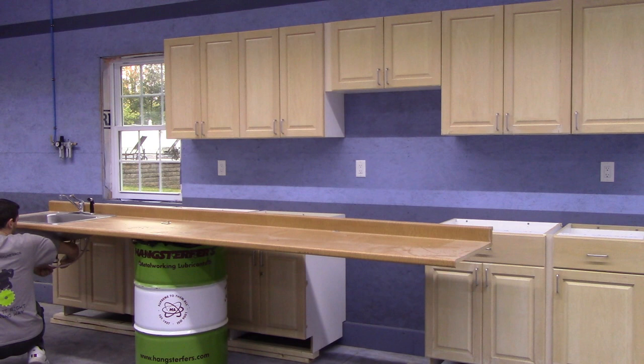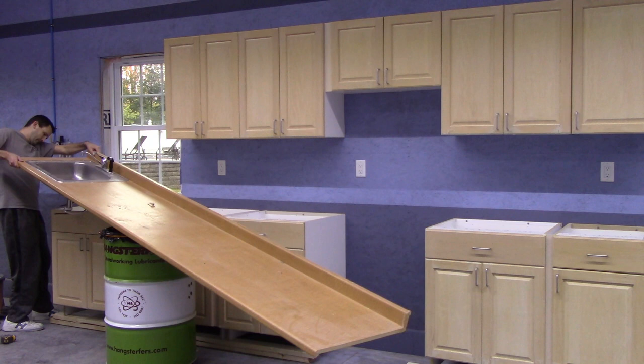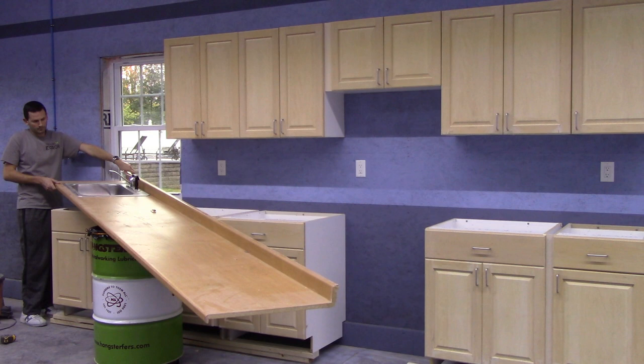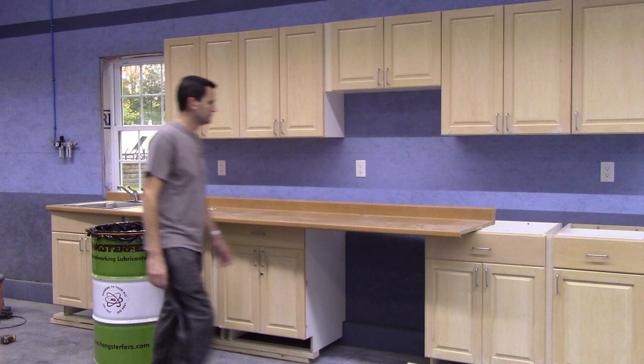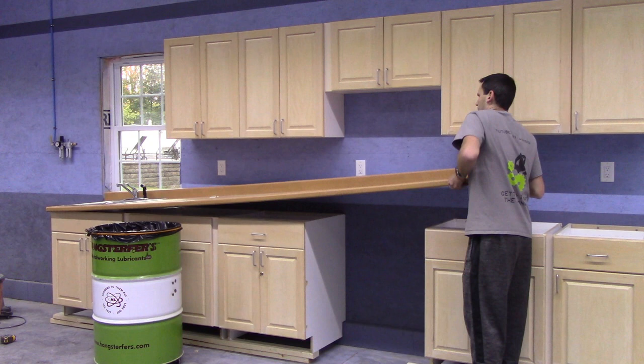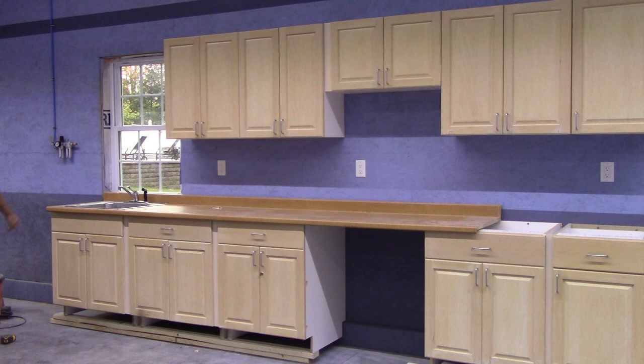So we're going to need to extend the countertop, and I can't find this exact color or pattern, and that's actually fine because I want to change it anyway. I'm going to pick up some additional countertop in any color, as long as it physically matches what we have. Then I'm going to try something I haven't seen: I'm going to use garage floor epoxy and do an epoxy coating over the entire countertop, which I think will look really cool, and it'll obviously make all the countertop one color. But it should also hold up really well to workbench-type activity. That'll be in a future video, but just so you know, that's kind of where we're headed with this.